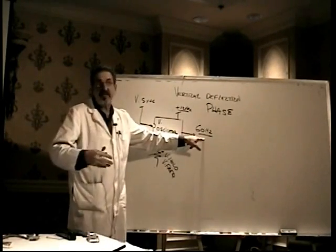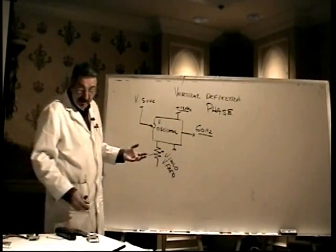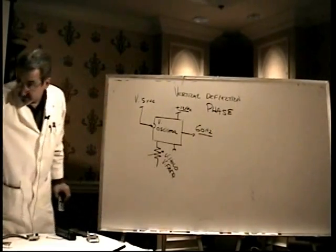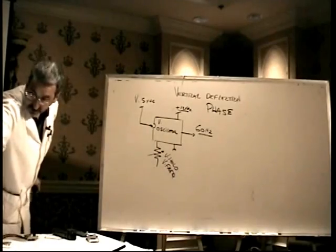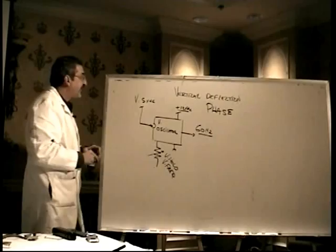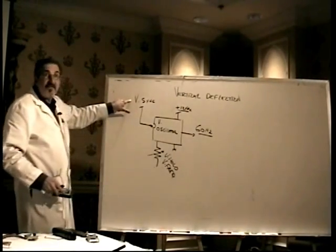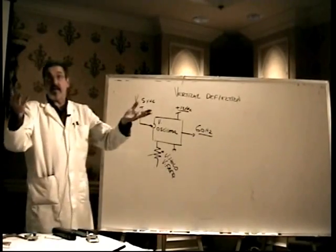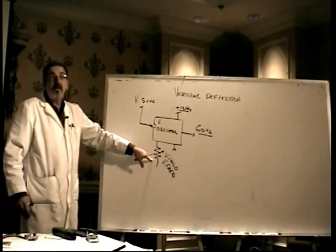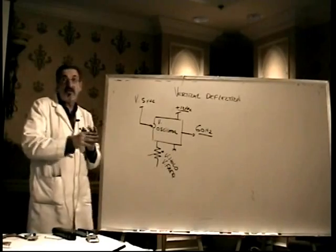So what the sync signal does is it comes in and locks that oscillator so it's exactly 60 hertz or 60.001 or 60.05 or whatever it's really supposed to be exactly, and so that it is in the correct phase so that the scanning starts at the top of the screen and ends at the bottom, doesn't start in the middle and come back up, so that it's exactly one field full of raster lines. If you do not have sync, the oscillator does oscillate at its own frequency, whatever you've set with the vertical hold pot, if it exists, or whatever it's going at. So you don't actually have to have sync to make it oscillate, but the sync slightly adjusts it so that it's at the correct frequency.